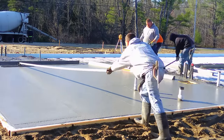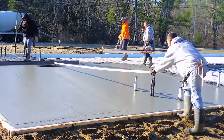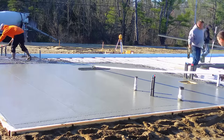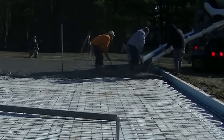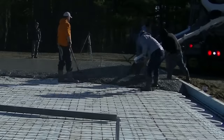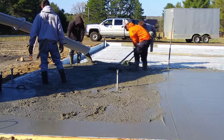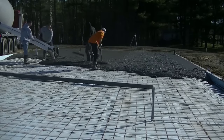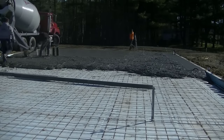There's a link for that down in the description if you want to check it out. Now, this is about a 40-yard slab, so talking a little bit about cost — I figure concrete at about $140 a yard, so right there you're talking about $5,600 just for the concrete alone. When I do the forming on something like this — the forming, insulation, rebar, and wire — I'm going to be at about two bucks a square foot just for that.